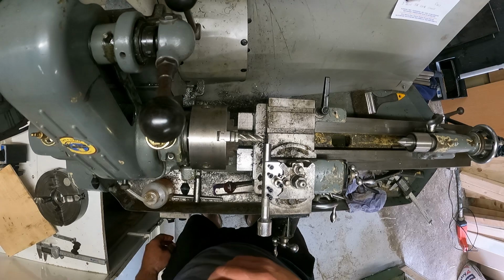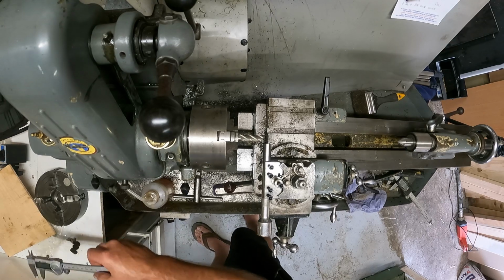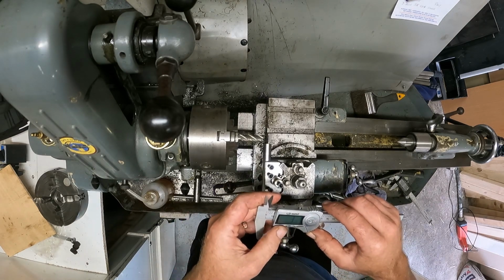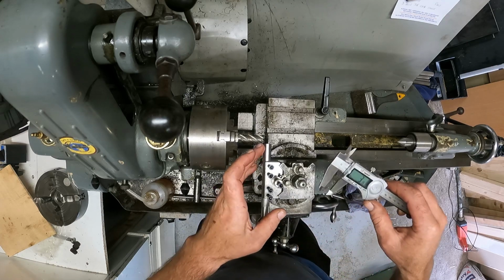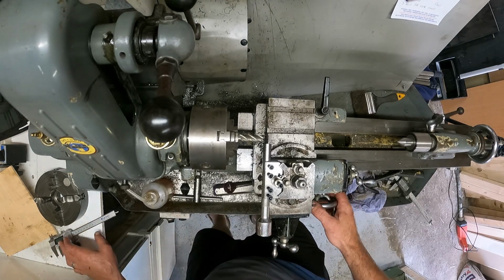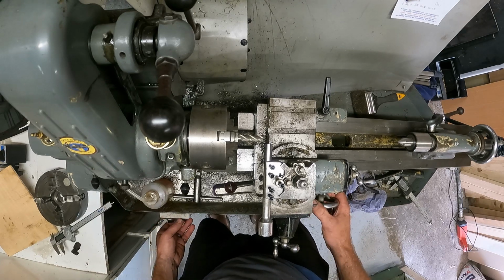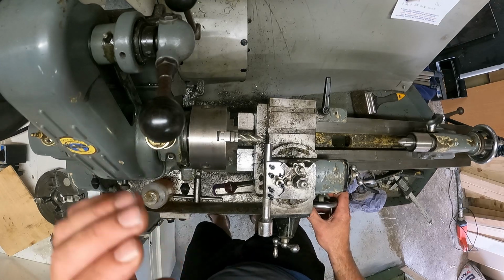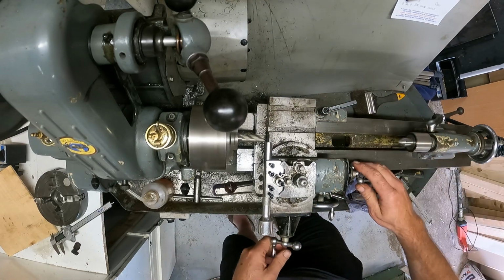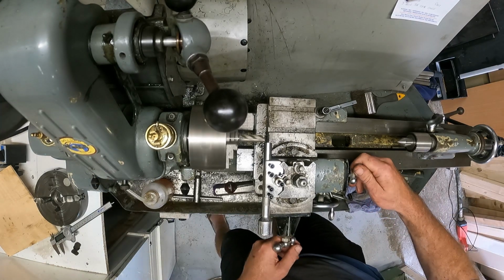Okay, I'm back. My battery was low, so I ended up having to go and get it charged, the camera battery. Okay, so I've got to take off 3.15 mil either side to square it up. Let's see what happens. Just get it close to start it up. I'll lock it there. Put it in a little.